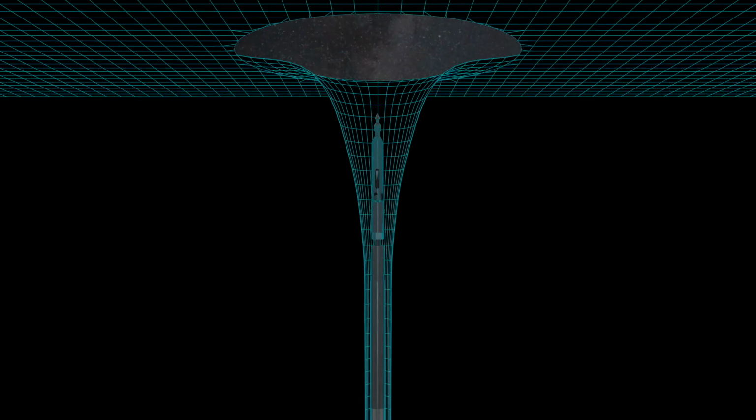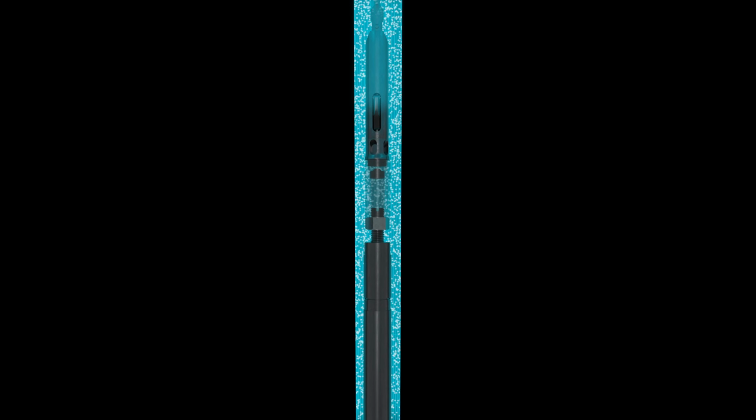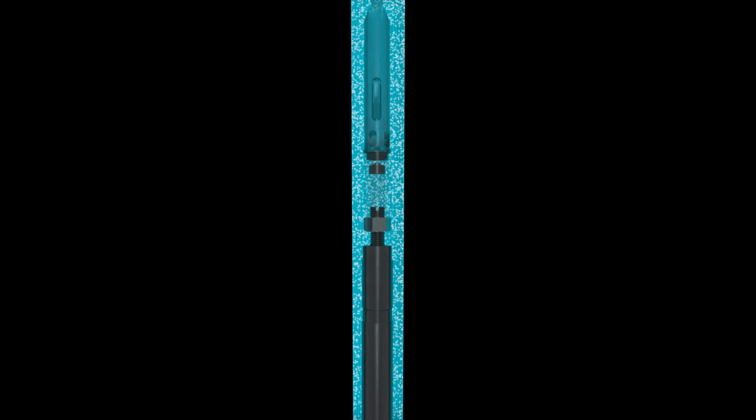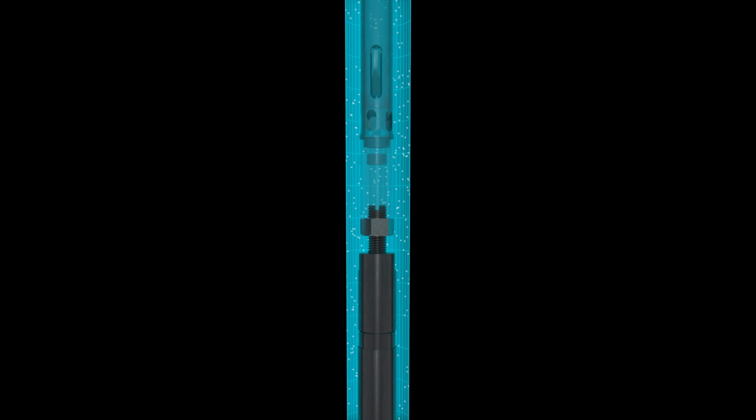Connect the water swivel to the drill string and slowly increase the water volume until it is approximately 10 gallons per minute, or 38 liters per minute. Continue pumping until the inner tube lands in the core barrel. When the tube lands, the water pressure will build until the landing indicator ball is pushed through the indicator bushing. When this happens, the water pressure will momentarily drop.